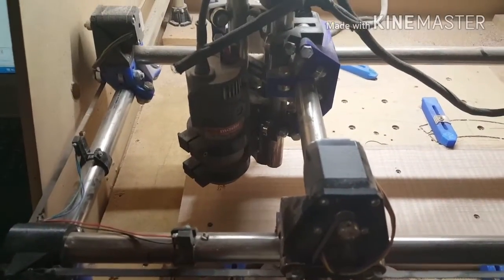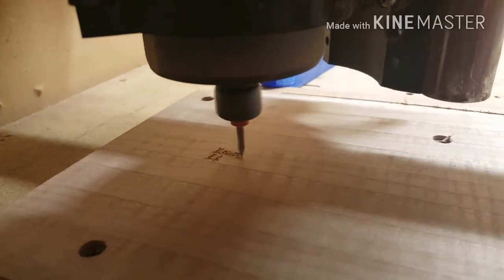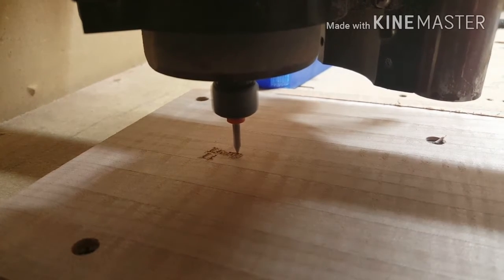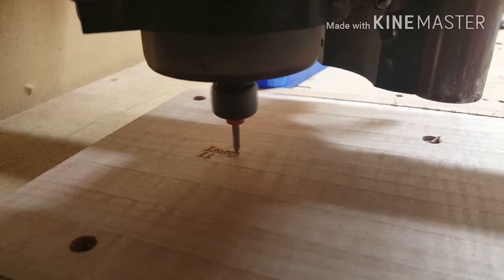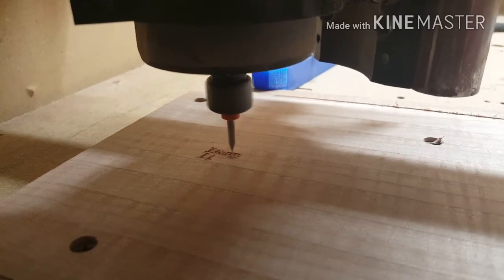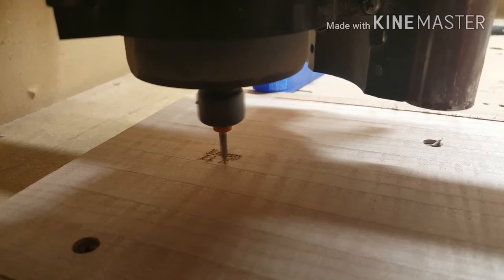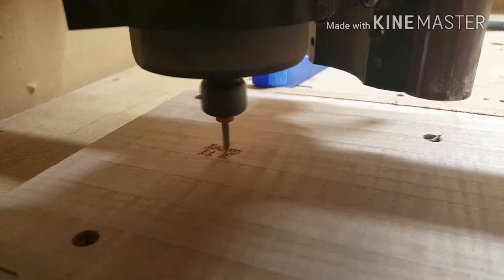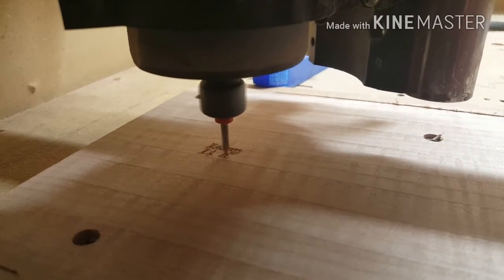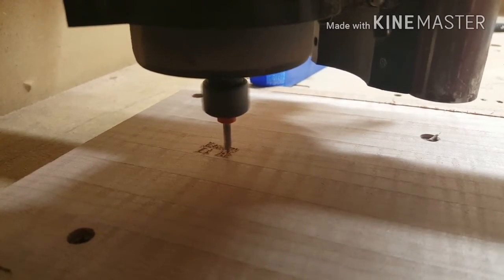As you can see here, I've started this engraving cut. I'm going to see if I can get in there and show kind of what it does. Now you see those fuzzies on there, but can you see how that bit moves up and down in Z height? And that's how you get those fine points and that defined, very small text. So this is a pretty slow process because it's a lot of letters, a lot of movement. So it takes some time. I'm just going to let it run.